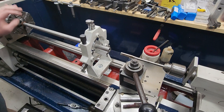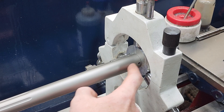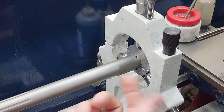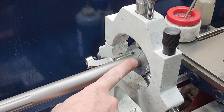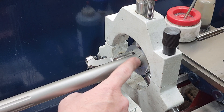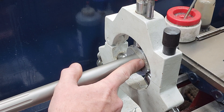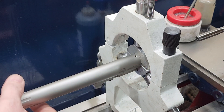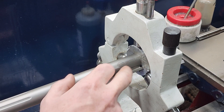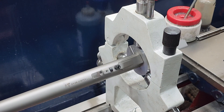So this is kind of an old-school way of doing this. What I did here — this is an aluminum bushing that I milled. This barrel is exactly one inch at the breech end, so this aluminum bushing I milled is about a half inch thick, and it's a split bushing with two screws holding it together. When I split this thing, I remachined the center of it, and there's only about six thousandths gap in between. So it's basically just enough to crush down on here, and when it spins, there's no jump on any of the rollers — the seam is gonna hit on one roller at a time, never two at once, because we're working on three rollers.